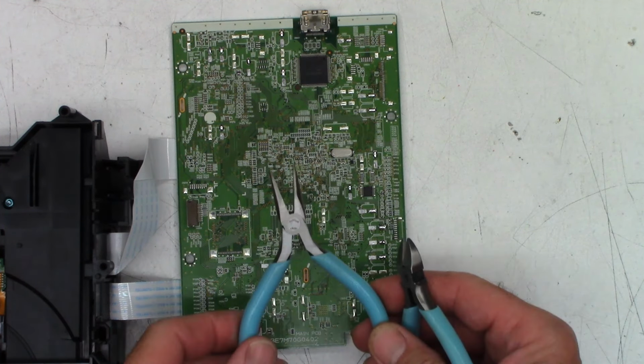where, like on this capacitor, if it were to bridge, I think those are connected, but I've had issues where I've done a whoopsie doodles and I've bridged a couple of pads. I believe that pad is not connected to the capacitor pad. Give them a quick little wiggle. Make sure they're solidly attached and that you did not forget to solder one lead of any of the capacitors, which I do not believe that I did.